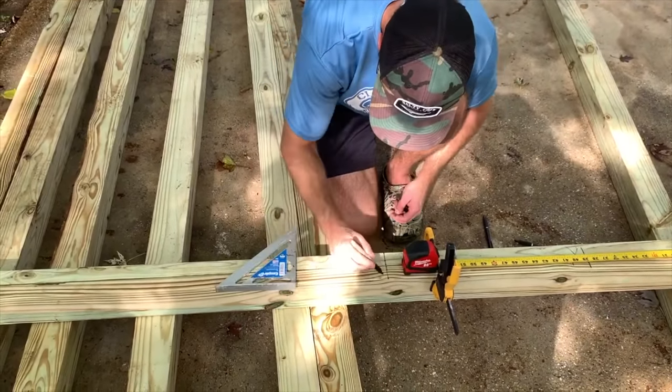After installing the first 3 horizontal full sheets, we're gonna cut that final sheet at the bottom. And in theory, we should cut that to 8 foot long by 2 foot 3 inch wide, but I always like to field verify. So what I'm showing here is I have the first 3 full sheets in place, and here is the 4th sheet of plywood that obviously overhangs the back of the shed.